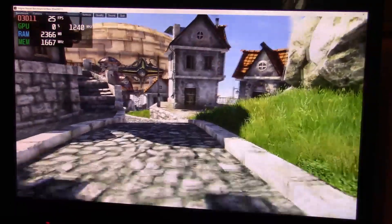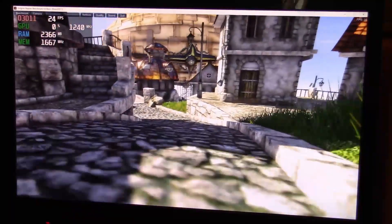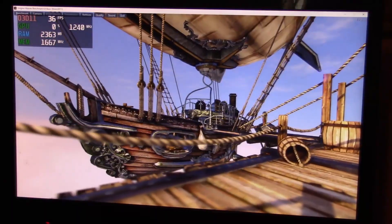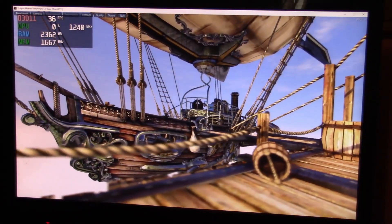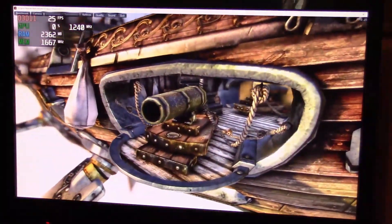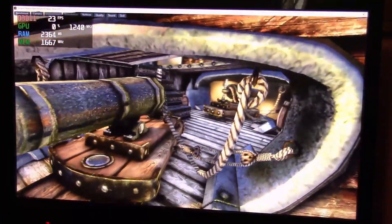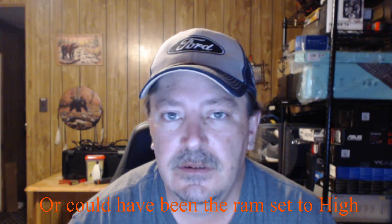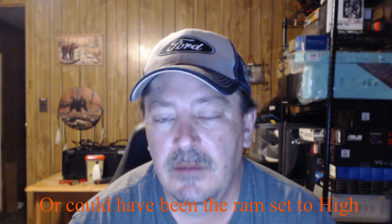We're not seeing it in the benchmark - it still doesn't look like moving that voltage up to 1.1 has done much. There's plenty of stuff going on with it. The plus and negative in the BIOS didn't work, and changing the voltage didn't seem to do much. Then it crashed. As you can tell, it ended up freezing in Heaven Benchmark - something wasn't stable. I believe it was the GFX voltage that I put in - I think that's why it froze up.